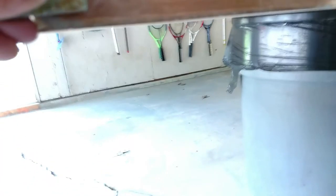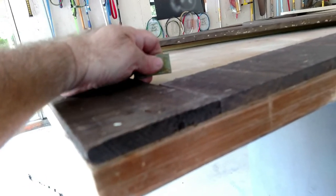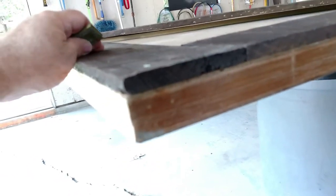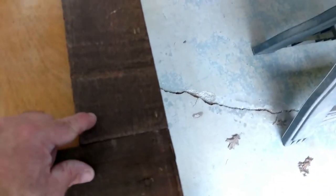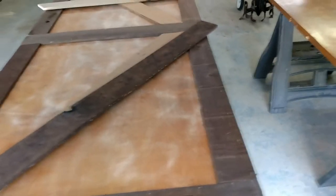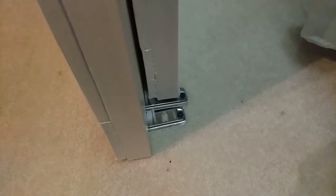These are one-inch staples and even with a little recess I'm nowhere near going all the way through. I did nail into the hollow side and it helped pull it down a little, since these boards are a little warped and made to be weathered. Nothing went through, so I set them with a slight recess — I'm not even going to fill them in. After we sand and paint, it'll be a cool look for the bedroom.